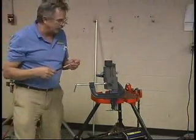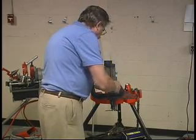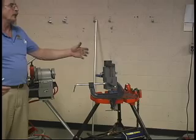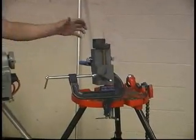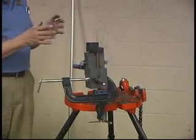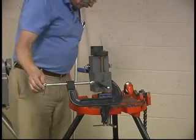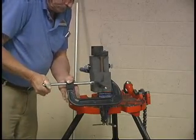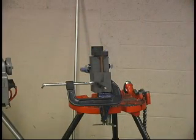Let's put our wire in before we get started. Another thing to do to make everything optimal is take a torch and heat up what you're welding and the mold a little bit to get it to a nice temperature — if it's really cold, you may not get the optimum weld. Put the wire in place, then take the igniter and attach it. First of all, make sure you have your safety glasses on, and I would also recommend wearing work gloves.